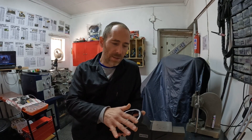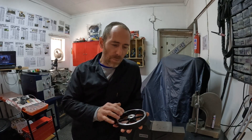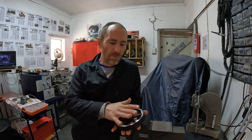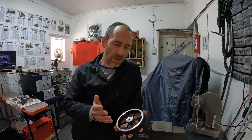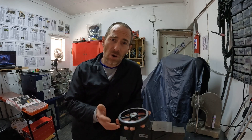If you're using the fabrication route, you do need to realize that things are going to move around a bit. You heat it up, the silver solder runs, and then it's going to warp. So give yourself a little bit of machining allowance — typically I would add between half a millimetre and a millimetre on each side. That is what you'd do for a casting anyway.